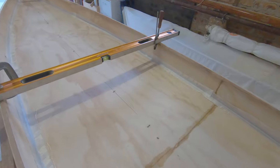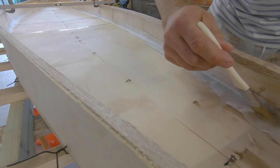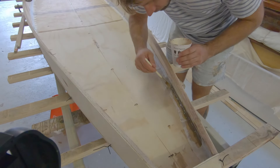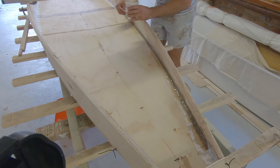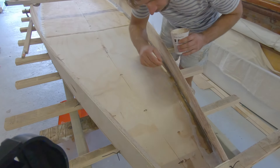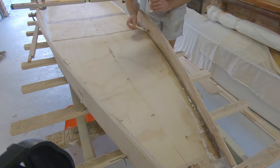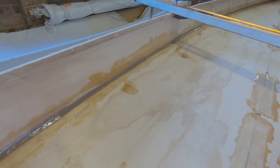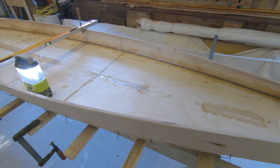I had some leftover six-ounce fiberglass cloth which I cut into strips to use for the fiberglass tape. Mix the epoxy, and you'll see I'm starting in the corners — I apply some unthickened epoxy in the corner of the tape first, which stops it from moving around, and then I come back and wet out the rest of the tape. The whole idea is that the tape strengthens the bond between the hull sides and the hull bottom, so you've got to make sure you wet it out fully. Take your time; you should have enough epoxy to get the job done one side at a time, then mix up some more and do the other side. If you mix up a lot of epoxy and try to do it all in one go, you may find the epoxy starts going off in your container. And this is the end result.